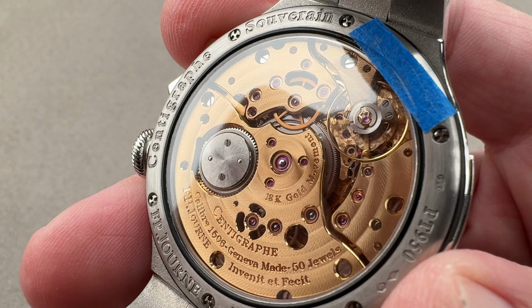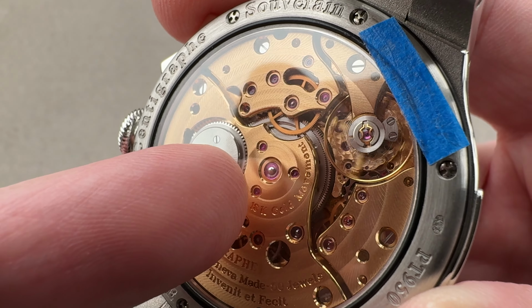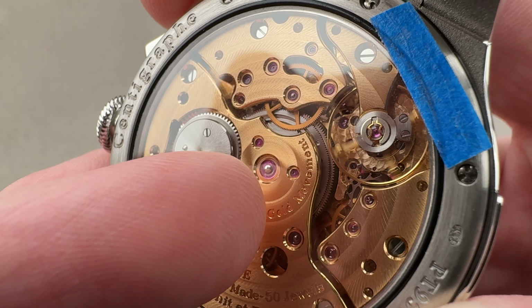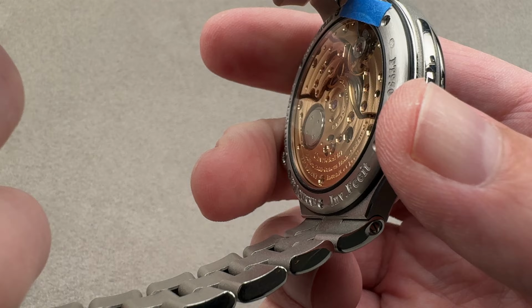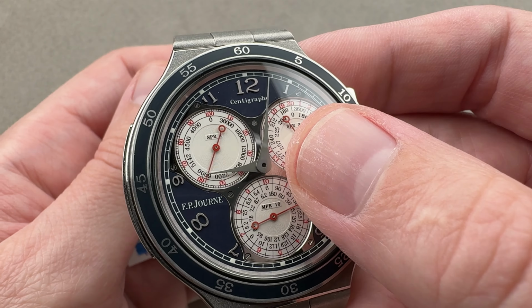And so 80-24 being the split power reserves, the barrel is at center, and that is for a reason. That is the second patented element on this watch. The barrel arbor, or basically the axle, has a toothed extension that drives the chronograph. And then the edge of the barrel, which you can see is also toothed, drives the time display.